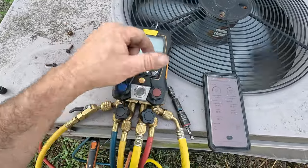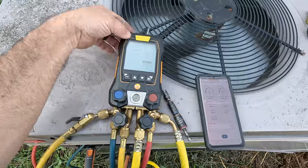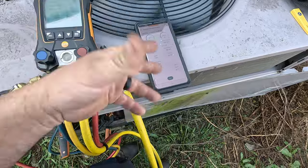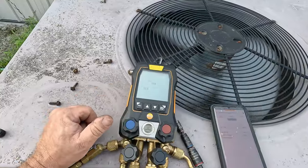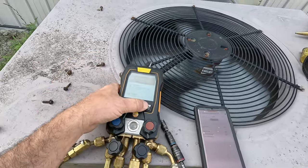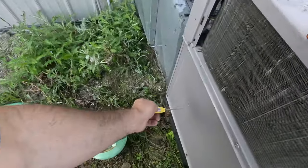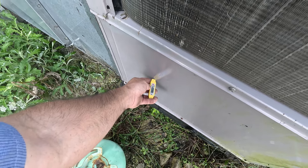If you guys are interested in any of that stuff, check out True Tech Tools — links are down in the description. Enter 'survival' and save yourself 8% off your total order. There are some exclusions, but that's just manufacturer preferences on some things. At least we're not flooding back — we're at 7 degrees superheat and it's coming back up. We got 53-degree discharge. I think we got 60-something coming back. Let's stick the regular thermometer in there and see if we've got an issue. May have found our issue with it freezing up. Yeah, we're coming back 74 degrees.